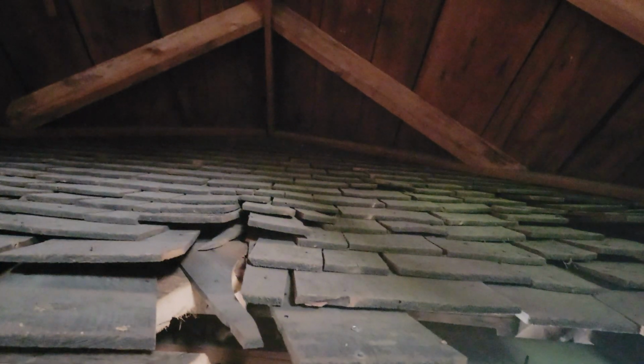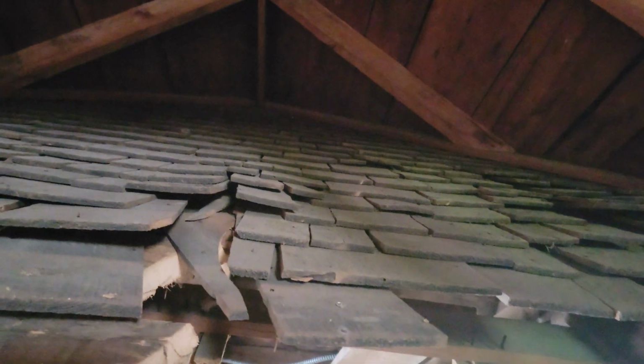Now turning around here, I still have the challenge of what to do to make sure it's easy that they can access that spot up there for foam. This is the sloped part of the original house where they put the addition, but they left the shingles on and the sheathing up there. And this part that you're looking at, they have to get the foam in there. It's not so important for them to get the foam in behind here, and that's it.